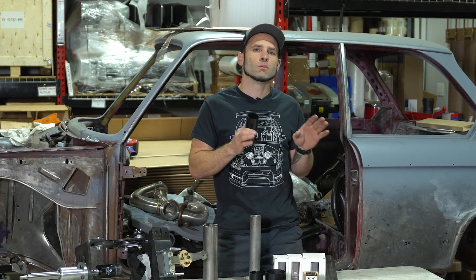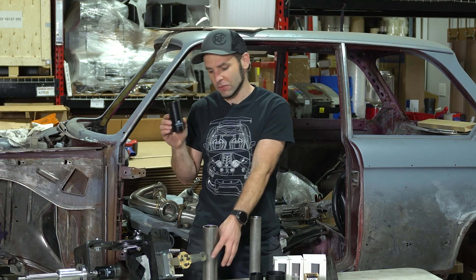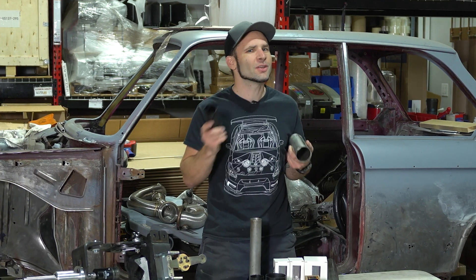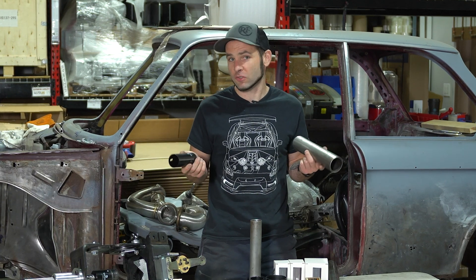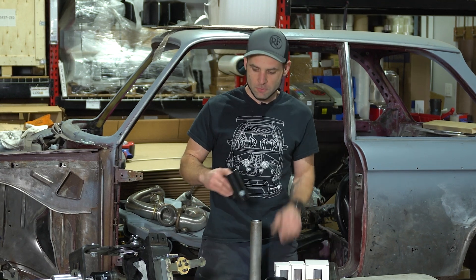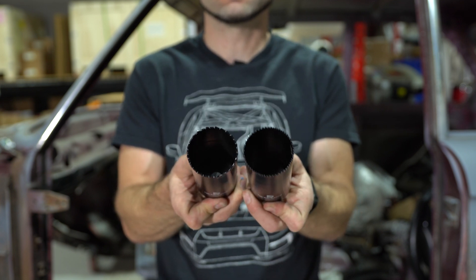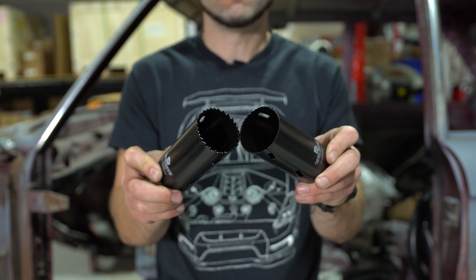We've promoted that in other videos, but we're talking about pitch. Why would you want to cut with a fine pitch? It's for cutting thin tubing. What are the rules? Here's the secret — you never will get in trouble. It's an opinion or experience-based decision you'll have to make for yourself. My favorite thing is to order one of each or three or four of each. These are exactly the same hole saw — two by fours — in four to six TPI and eight to twelve TPI. They're really similar in price, so you can try them both out and see which one you like better.